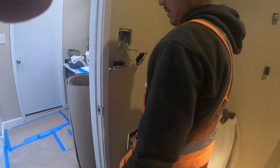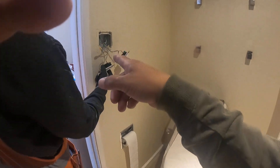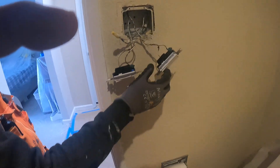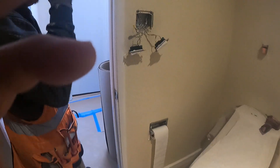There's no more room in the panel — only one spot left. We have to open the drywall to run the cable. Our plan is to run a 4-gang box here since one slot is for the heater and one is for the light. We're going to cut the drywall — hopefully there's no stud here. There's no stud here, only over there, so we can drop it a little bit lower to 48 inches.